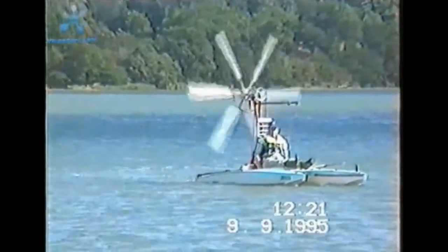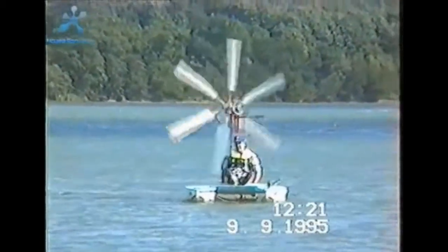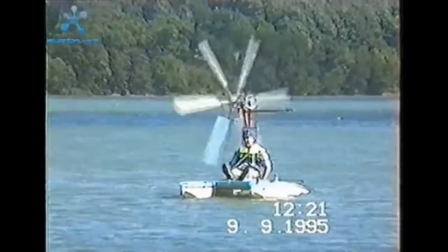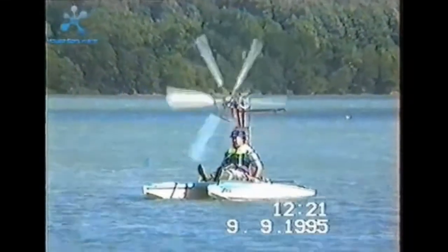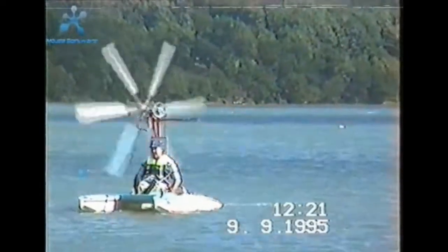At this angle, the blades rotate at the same speed as the wind. This is a very slow rotation speed compared with the type of wind turbine used on land. There are several advantages — the stresses on the blades are much lower than on the land wind turbine.